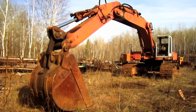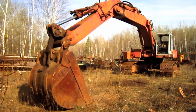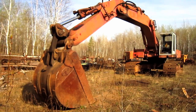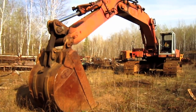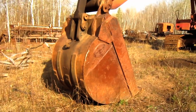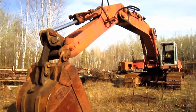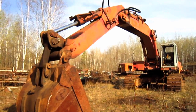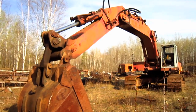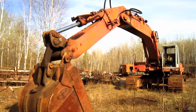Available from Poclain in either front shovel or backhoe configurations, depending on what the customer preferred, the Model 220 CK was designed to swing a bull clam ranging anywhere from 3½ to 4½ cubic yard capacity in front shovel configuration, and swing a rock bucket ranging anywhere from 1⅞ to 2½ cubic yard capacity in backhoe configuration. Multiple different stick and boom lengths were offered for the 220 CK in backhoe configuration, depending on what the customer preferred, to match each job application. This particular unit is equipped with a 12-foot 6-inch stick and a 23-foot boom.